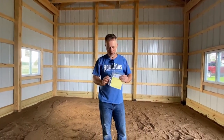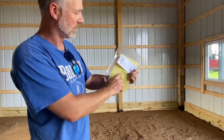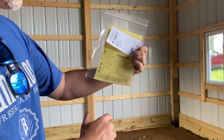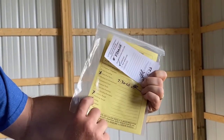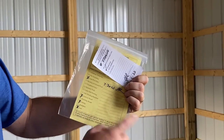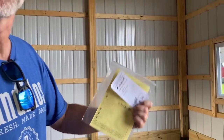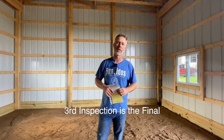Obviously if you're doing electric or plumbing, that'll be a secondary thing on your permit. You can see this barn right here — the inspector came out at 7:30 for the post holes. He's going to have an electrical rough-in done by somebody else, and then his framing and final inspection together. Once the concrete is all done, it's pretty simple. If you have a good builder, your builder will help you walk through the process and give you any tips or suggestions you need.